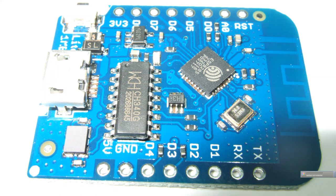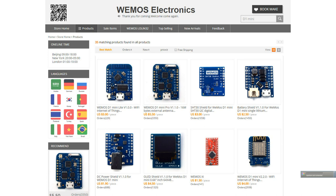The other module, however, is completely new. It is called LITE because it has only one megabyte of flash memory. The rest of the specs seem to be the same as the normal D1 Mini board. The build of the board is completely different — it has no metallic shielding and I think also no FCC certification. It has a different chip: instead of the ESP8266, it has its small sister, the ESP8285, which already has one megabyte flash on board. And it is a dollar cheaper than the normal D1 Mini, at least in the Wemos store on AliExpress — and I buy the original, because I think Wemos deserves it.